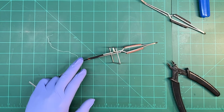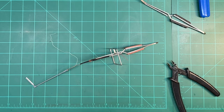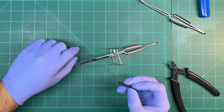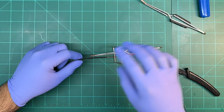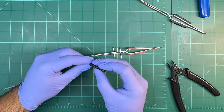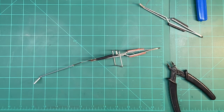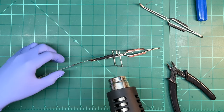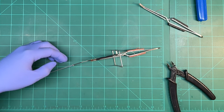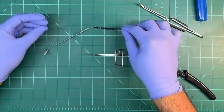You want the wire and the resistor super hot so the solder just wicks in. Get it a little hot there - this time I'm just going to put the solder down and run it across. There we go, now it's all soldered up. I'm going to put another 3/32-inch piece of heat shrink over it, then heat shrink that. After that I'll use a larger 5/32-inch piece so I can keep the white and red wires together. Hit it with the heat gun - and there it's all set. All these wires are hooked up and ready to go.